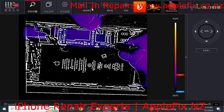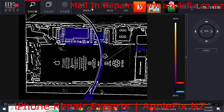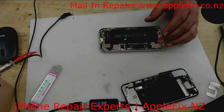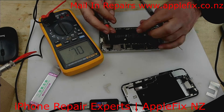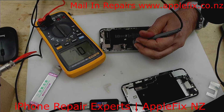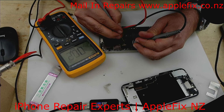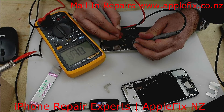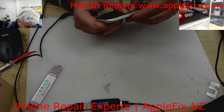We don't care what it is as long as the short is gone. We'll come back under the microscope and check if the short is relieved. Now checking: this is the ground side — same — and this side, before it was about 3 ohms and now it's 68.1 ohms. That could be ignorable but we'll check.